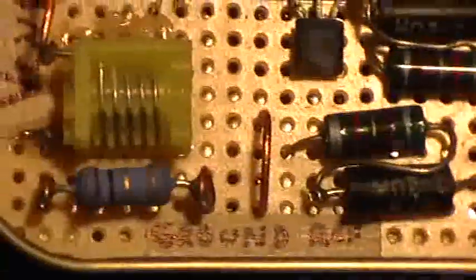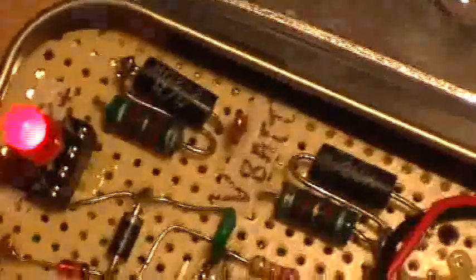You'll notice I have some monitoring points in there — ground reference, VCVR. That blue 1-ohm resistor right there is the current monitoring resistor. The yellow thing on top of it is just a little added inductance — a slug-tuned inductor. And over there is where the V-battery trace is taken, directly from the battery with just this one series inductor, about 4.4 microhenries.